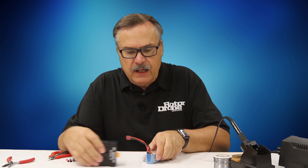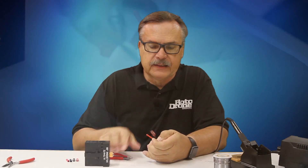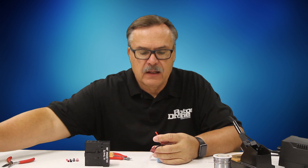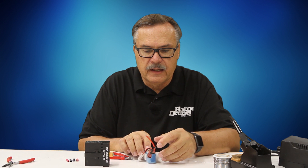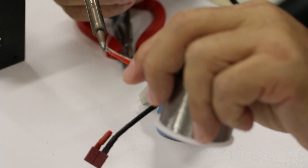Again, I like to work one wire at a time because it is a live battery, so I don't have to worry about the wires touching together and igniting, which wouldn't be fun. You need about an eighth to a quarter of an inch of wire stripped to fit right in there. We want to tin this wire to make it all one clump.